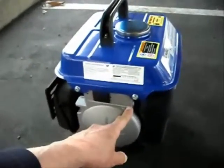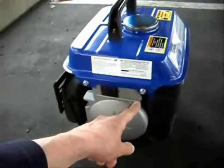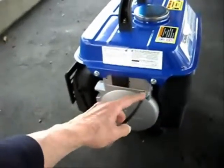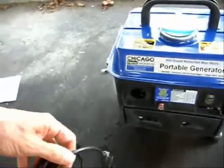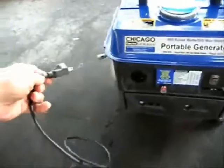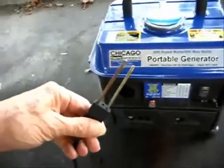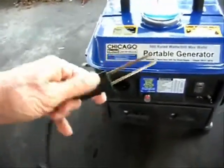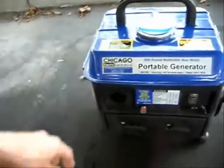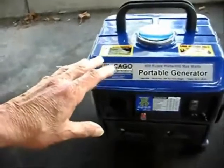This is a static discharge issue, so I didn't want to hook up a long chunk of cable. I took some extension cord wire with a female plug and hooked it up. Then I took the power cord for a regular computer — it has a normal plug at one end. On the other end, I cut the heads off two framing nails and pounded them into it, so I can jam them into the ground. It needs to be non-organic dirt. This way, instead of building up static and causing the generator to speed up and slow down, it should run much steadier.